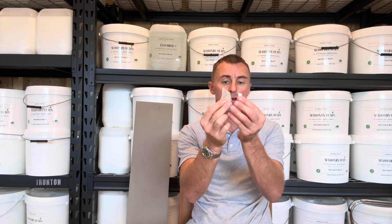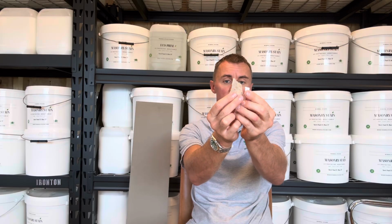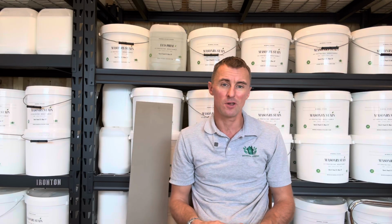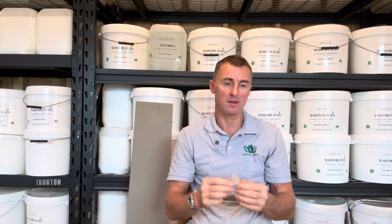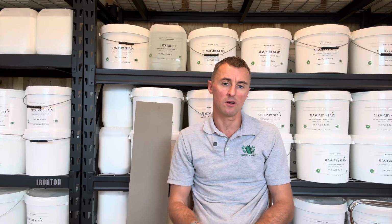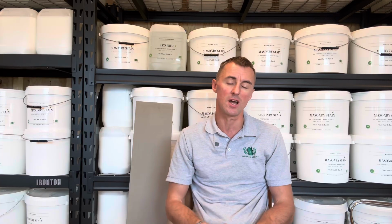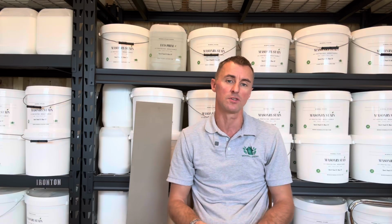And when you use earth and mineral pigments, that's where you could get up to 20 years or more, depending on your substrate and the quality of your brick home or stone, EFS, stucco. When you use a regular paint, 3 to 5 years. What's known as resin is the protector film on that paint, and that is going to wear down over time. And that's another factor to consider, that if you end up staying in the house and you did a project not knowing that silicates exist, you're going to have to repeat that project every so often.